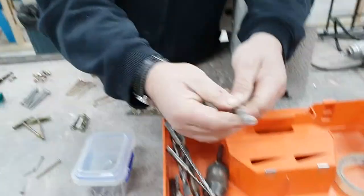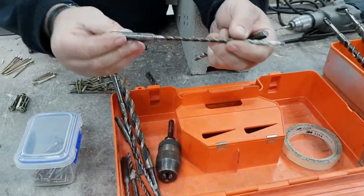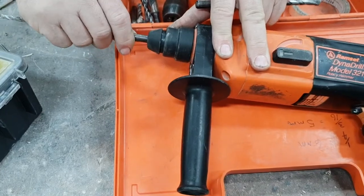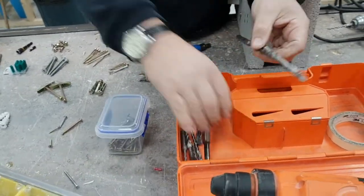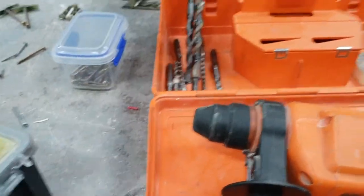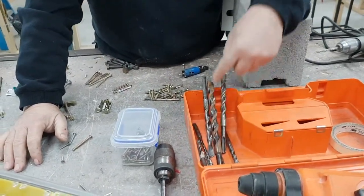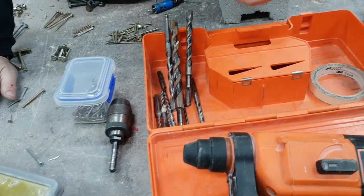These larger drill bits are totally different — they have a keyway on the end and are specifically designed for the Hilti-type hammer drill. You can sometimes get a universal one with the keyway cutting on the side. They slot in: you push it in and it locks onto the keyway; pull back to remove. These are designed for hammer drilling only — not used as normal drill bits. You also have the option of removing the SDS chuck and fitting a keyless chuck to use standard drill bits.